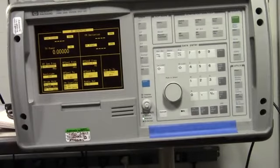To adjust the transmit level out of the SR1, there are 2 dip switches to boost the transmit gain, and then there is a DTMF command #11 that lets you set your transmit level in essentially percent. By default it's at the highest level, 99%. So what we'll want to do is keep turning on dip switches until our deviation goes above 3 kilohertz, and then use the DTMF command to dial it back down to just 3 kilohertz.